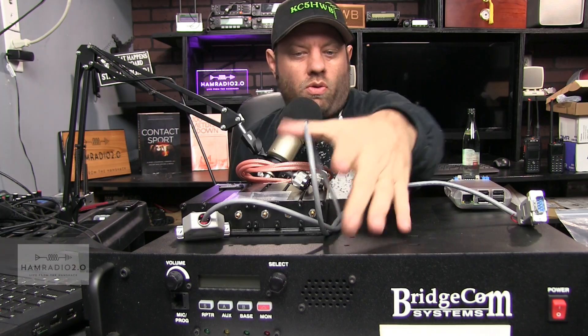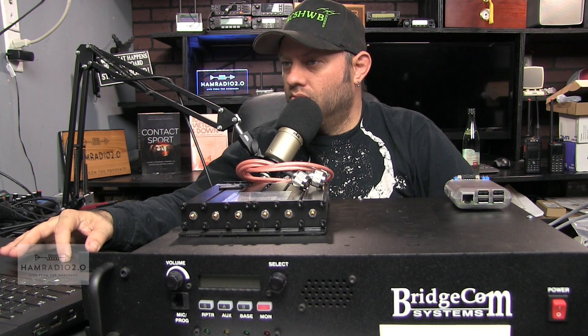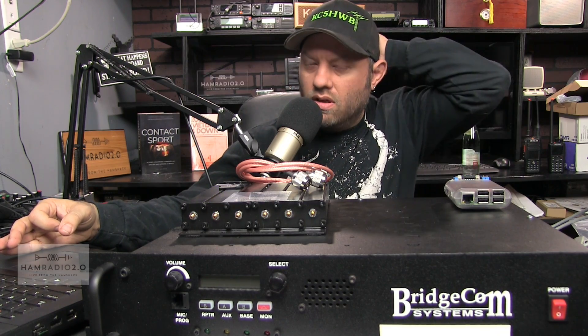The transmit option you're supposed to do with a spectrum analyzer, which I don't have. But this specific unit has already been customized for this repeater by BridgeCom. BridgeCom doesn't sell this — it's sold by RepeaterBuilder — but since this was a demo model they set it up for me. Basically all I've done is reprogrammed it to my frequency, call sign, and settings within PyStar. According to BridgeCom, you go into the MMDVM Cal program under SSH, transmit in DMR, and set it for 2.9 kilohertz deviation on a service monitor. A lot of times you'll read 2.5 is the correct setting for PyStar transmit on a repeater, but apparently they use 2.9 kilohertz and say it works better.